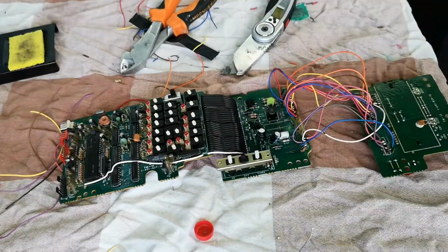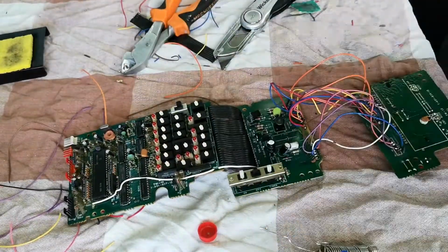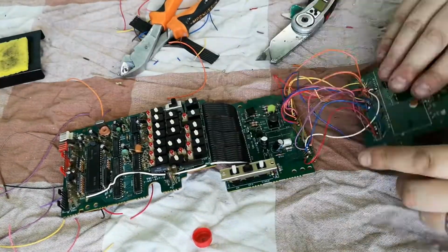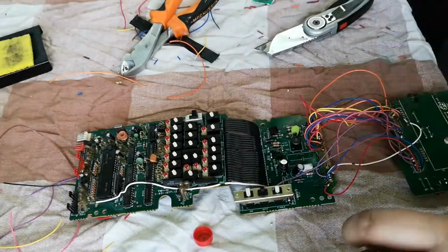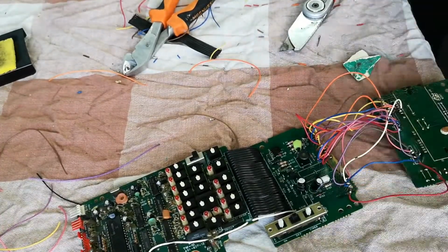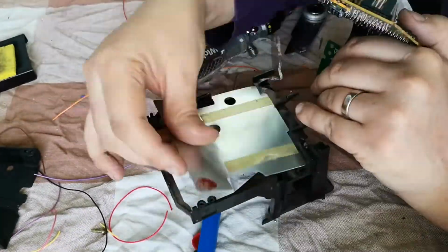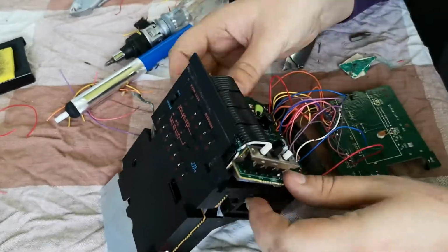Incidentally, those cables came out of a Hitachi VT11E. They were the right size, and I had a load of them, so it made sense to use them. But what you also need to do, because you've got such thin space, literally millimeters of space between the actual soldered joints, is get that knife blade in between each soldered point. It is essential, so you can get rid of any links between the solder itself, any points where it may be bridging, for example.